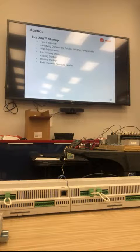I think on every unit, set points are also going to have to be made and adjusted. Space control, like I said, is a little bit too forgiving, especially if they have a VAV system that writes the space at that point to the unit, then you probably don't have to make adjustments.